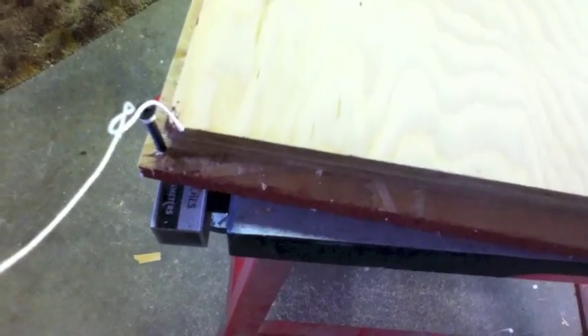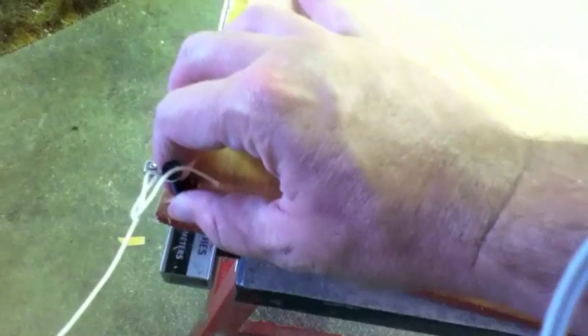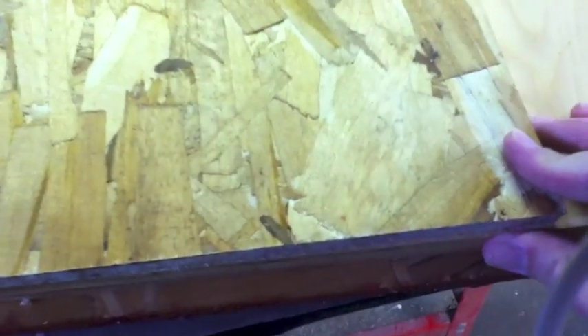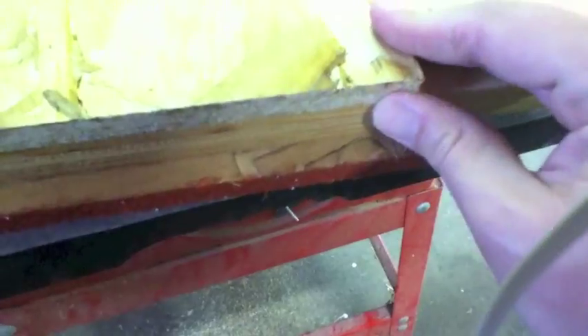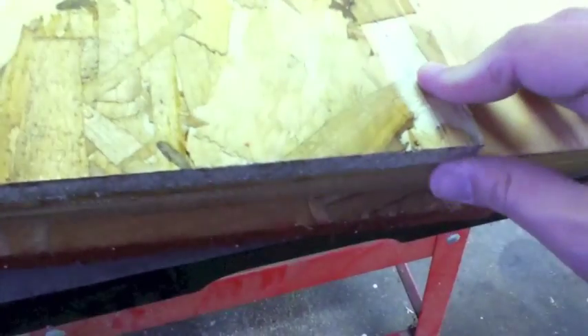I had a piece of three-quarters ply that I back up into that screw and then just kind of measure and center it — it doesn't really matter exactly as long as it's somewhat squared. Then I take this large chip particle board, could be plywood or solid wood or whatever, and I even that up to each edge. I'm smoothing that edge here and on this side too — this board isn't perfectly square so I just minimize the gap.